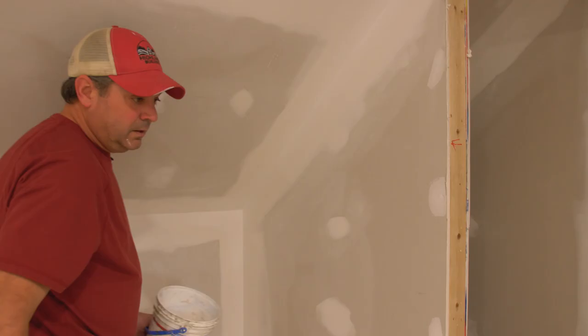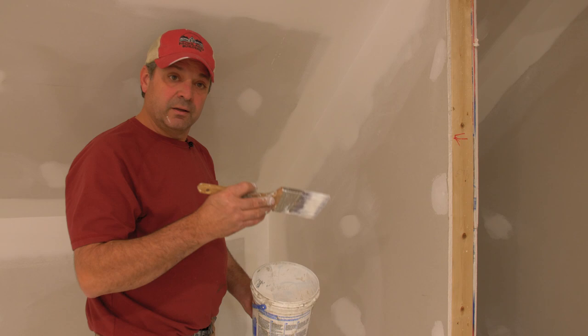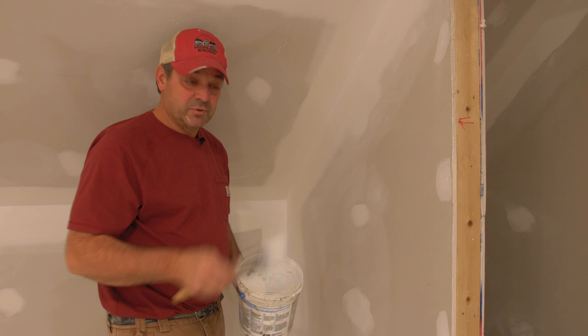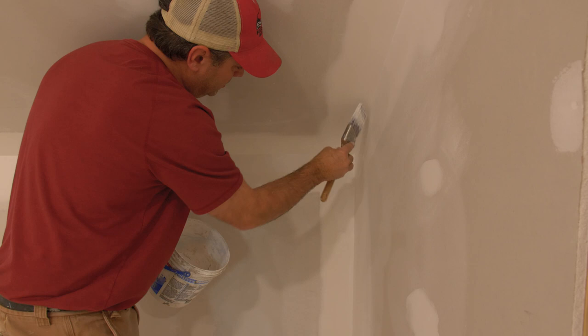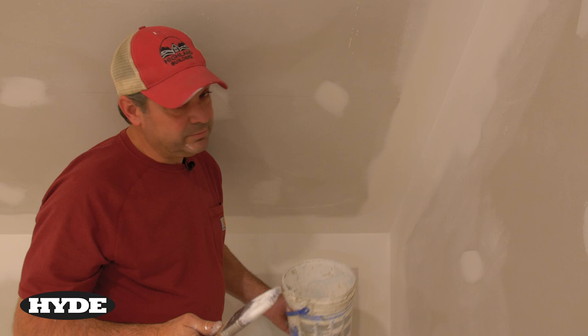One last thing to stress: when you're cutting in before you roll, make it as smooth as possible — no big heavy brush strokes or blobs of paint. You want it to be as consistent with the texture of the roller as possible, with no stark difference between your cut line and the stipple from your roller nap. When you bring paint into a corner, do all sides and smooth out any high areas of paint. It's also important to have a good brush, because you won't be able to get a smooth finish otherwise — so don't cut back when buying a brush either.